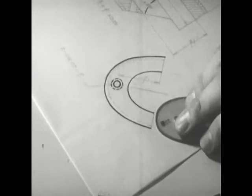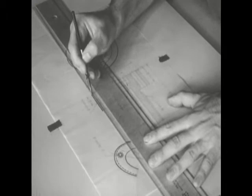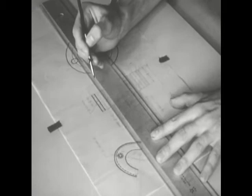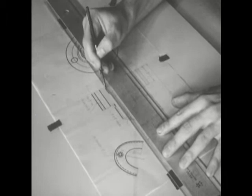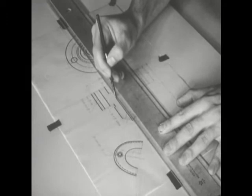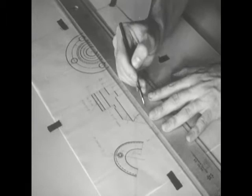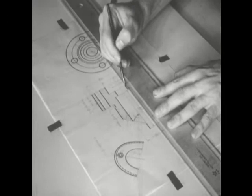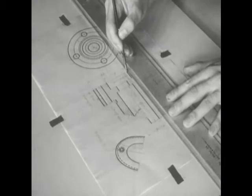Horizontal visible straight lines follow non-circular visible curves and are drawn with a ruling pen and T-square. Horizontal lines are ruled from left to right, beginning at the top. By being careful to ink each visible line segment as it appears, once over, the drawing takes care of all the horizontal visible lines.